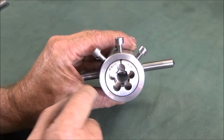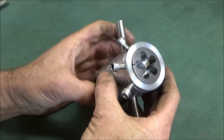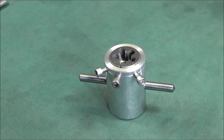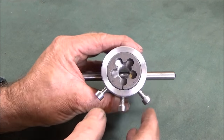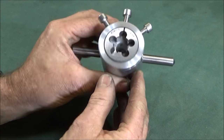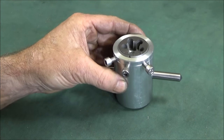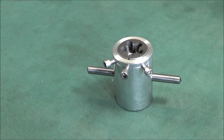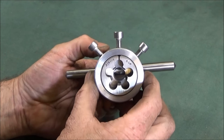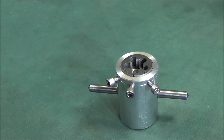So what I do, when I buy a nice piece like this from a seller on eBay, I save that seller to my favourite sellers list for all future purchases. And then I know I'm getting high quality aluminium, which is a pleasure to machine, and these bar ends and billets are often much cheaper than buying actual lengths of bar. Plus you can buy them, like I did with this one, to the actual diameter that you want, and save a lot of time on machining.